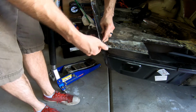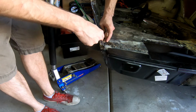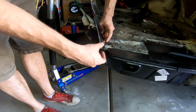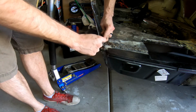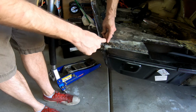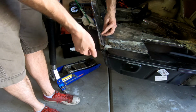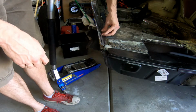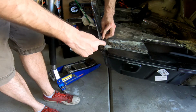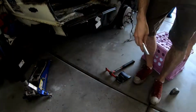Looks like it still needs maybe a little bit more bending here. But I just used a right angle piece, that way I could sort of tap and add that curve, just little taps at a time, and then constantly check it against where I'm going to place it. So I think, like I said, that turned out really well. So now we will go back, finish that out, cut out the old piece and put in the new piece.